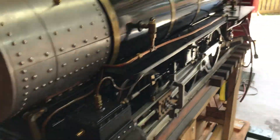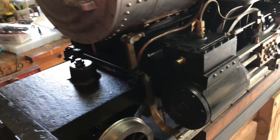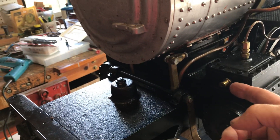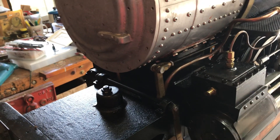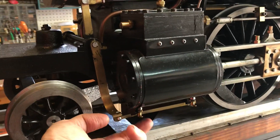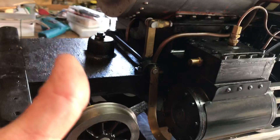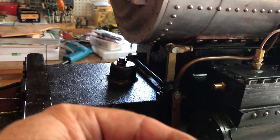Several things I need to address: I built these snifters probably six or eight years ago, and there are little ball valves in there that close. Those were apparently stuck because there was a little steam coming out. The cylinder cocks — little drains — were also not closing perfectly, so I need to fiddle with those a little.